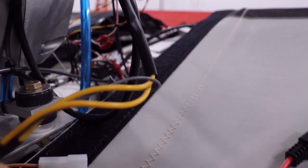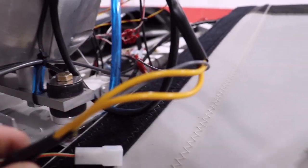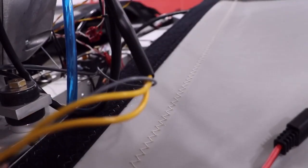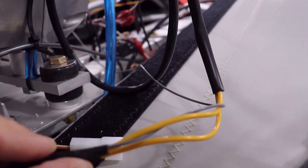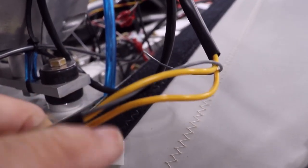On this plane, the wires that come out of the battery are connected to the mating plug, which plugs in from the charging circuit. You'll also notice we run a gray wire from the wires coming out of the engine from your generator stator. This is the gray wire that comes from your Grand Rapids EIS, and it supplies information to your tachometer. This gray wire can go into either of the two yellow leads.